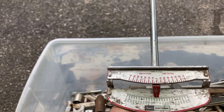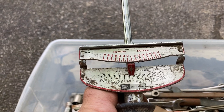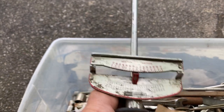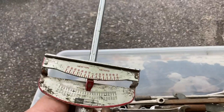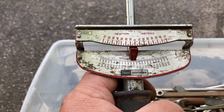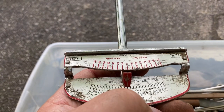Turning torque — what is it used for? At least for me, turning torque was always useful when you're putting bearings together, something with a bearing where it needs a certain drag. For example, a rear diff — you're setting up a rear differential, so you put the pinion bearings in with no seal, and you have to do a turning torque. That means you have it assembled — no ring gear, just the pinion gear with the two bearings. You put this on there and turn it in circles, and it might want 20 inch pounds of turning torque. So as that thing is spinning, this would go to say 20.